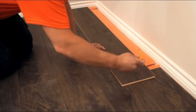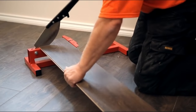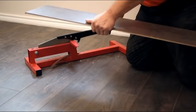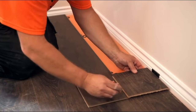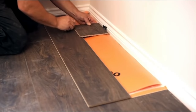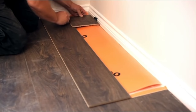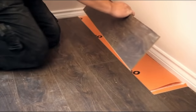So now we get to the last row. Put the board you want to fit into position, measuring and removing any excess length as necessary. Then, with a piece of offcut, place it on top of your board and against the wall and skirting. Draw a line on the board you want to fit, remembering to leave about a centimetre for the expansion gap. Remove any excess as necessary and fit your remaining flooring.